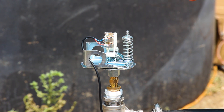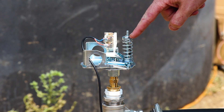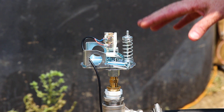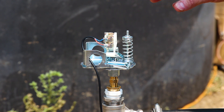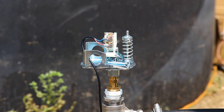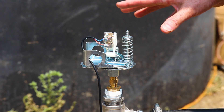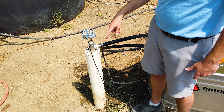There is an adjustment screw for the cut-on and cut-off pressure. It's preset at the factory for turn-on at 30 psi and turn-off at 50 psi, which can be a little high for some setups. Turn this screw counterclockwise to reduce the turn-on and turn-off pressure. If you raise the float valve and the contacts aren't closing, back off this screw until the solar pump can generate enough pressure to trigger the switch. During troubleshooting, I like to leave the cover off so you can easily see whether the contacts are open or closed.